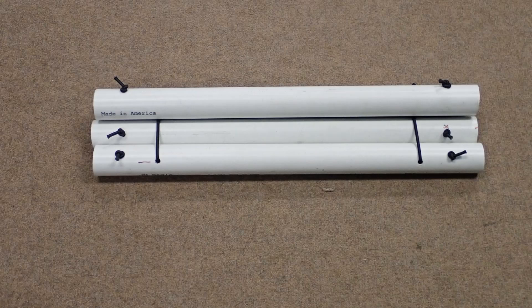This works best if you have an odd number of sections such as three pipes, five pipes, or seven pipes. In this case, I only have four, so it does not wrap up as neatly as it could if I had five sections. One question that may come up is why did I not just use two pieces of shock cord with a top and bottom set of holes? This is because it's somewhat easier to adjust the shock cord length in order to get the correct sizing for both AL-80s and AL-40s.